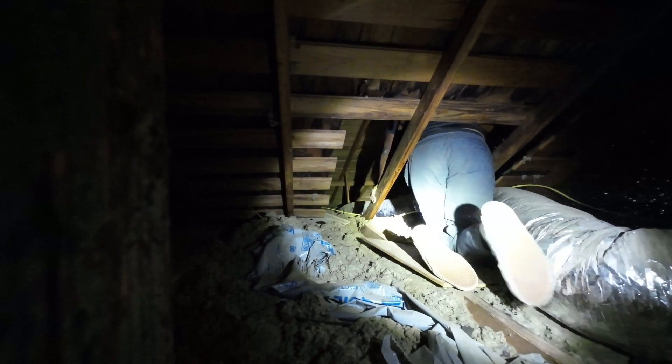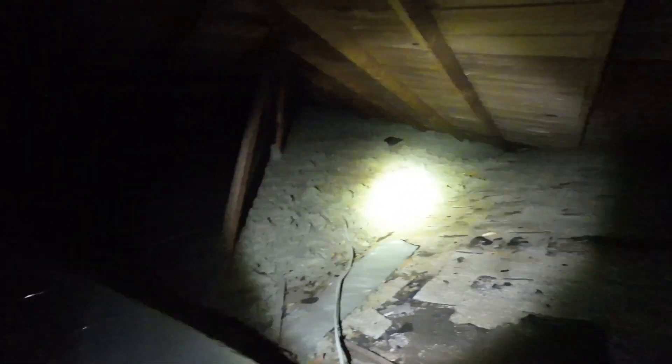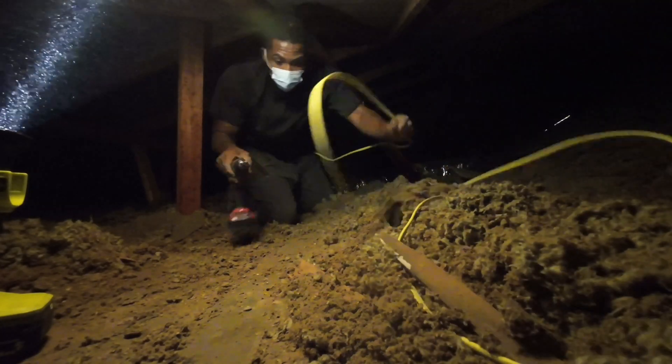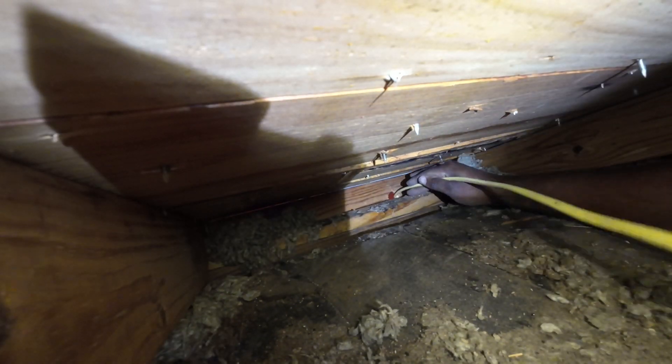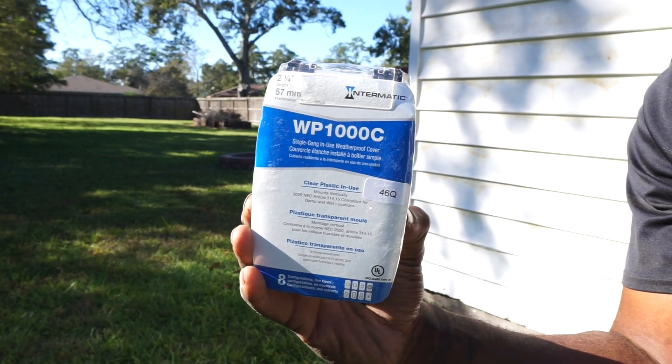This is the access hole we're going to have to go through for the add-on. It's pretty tight in this area — really tight — so I had to make a little pathway. Me wanting to add the receptacle under the eave/soffit, I thought I would have access but I didn't. So I had to get a paddle bit and make a small hole so I was able to feed my Romex down to the eaves section. I guess it just depends on the home — some might have access, some might not.